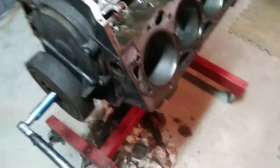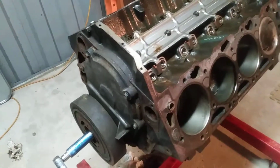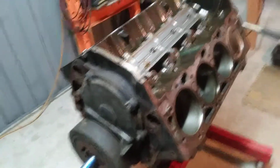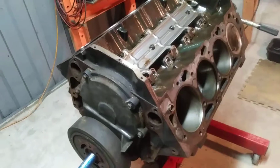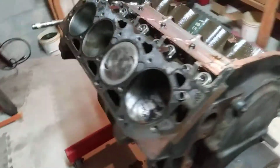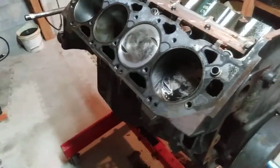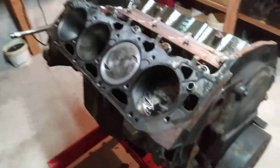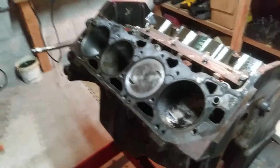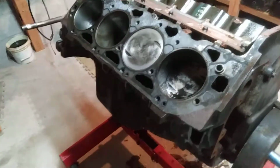Before I forget, this is very important. This is something I was thinking about a little while ago, and I thought I remembered the most important thing, but I had not. What I had in the back of my mind was assessing for hydrolock. When you go into an engine like this that you don't know the history of, and you open it up and it's full of water, one of the first things you should think of is, did someone try to turn it over when it had any amount of water in it and create a hydrolock, which would warp a connecting rod?